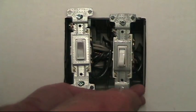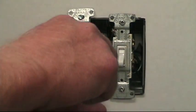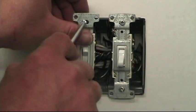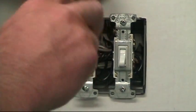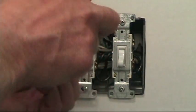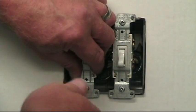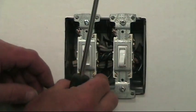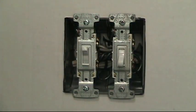Not too tight — you don't want to tighten it down too tight against the drywall, popping a screw somewhere. Start one thread partway in, then start your second screw and you can bring that all the way in, again making sure you're centered in that oblong hole of the mounting strap. Not too tight, because if you do need to adjust them a little bit when we go to put the plate on, you can just move them slightly one way or the other without having to loosen and re-tighten your device screws. So there you have it — ready for the faceplate.